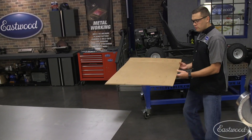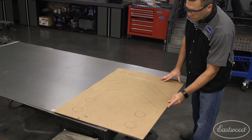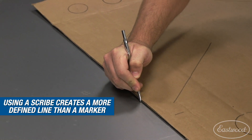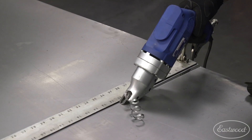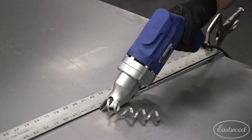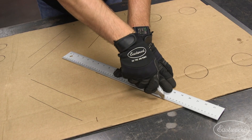Getting started, transferring this pattern over to metal is as easy as squaring up the corners to minimize wasted metal. From here, a scribe along the outside edges makes a clear indicator of where to cut. Once the cardboard has been removed, I like to clamp down a straight edge when using the electric shears to guide my cut — this takes out any chance of driving all over the place while cutting.